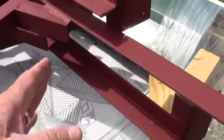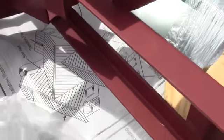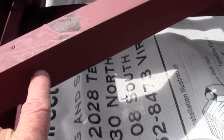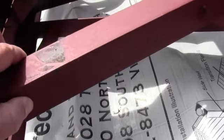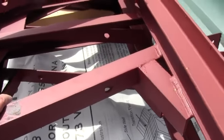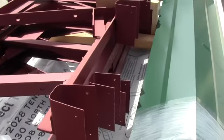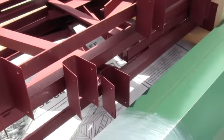Here's your overhang that you can see past the post — about 16 inches. Here's the 6x6 sitting here. Here's your lags that go right through to lag right into your post. Everything's engineered. You don't have a header board or any of that kind of mess. You can go in 10 and 12 foot increments — we've got an engineer for that in an agricultural type setting.